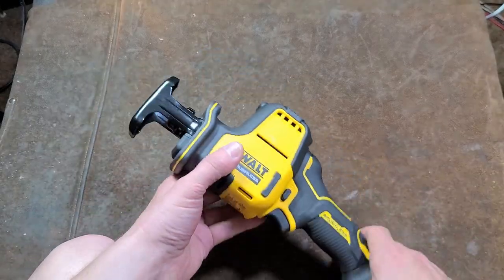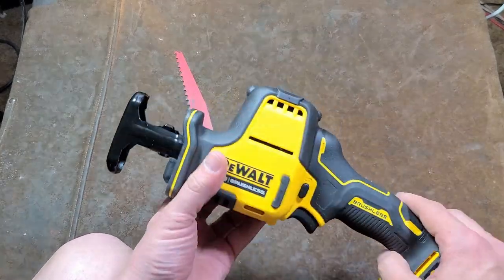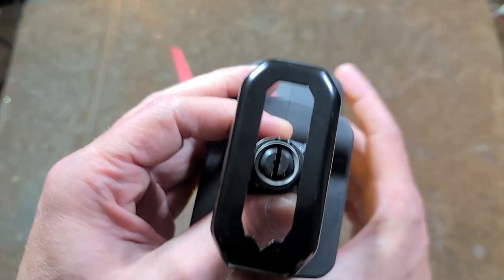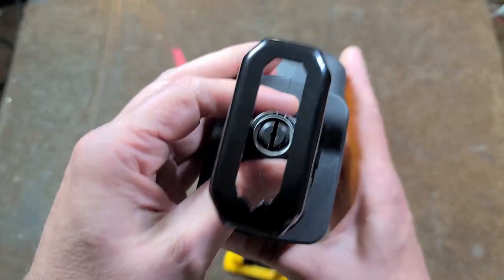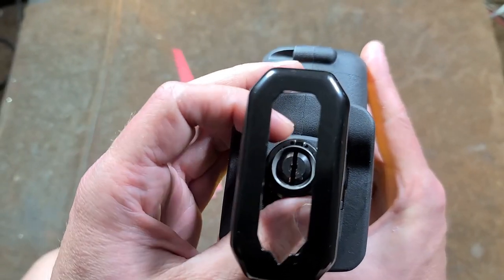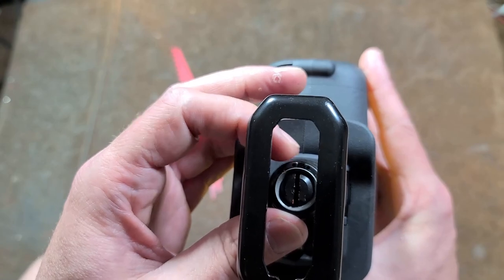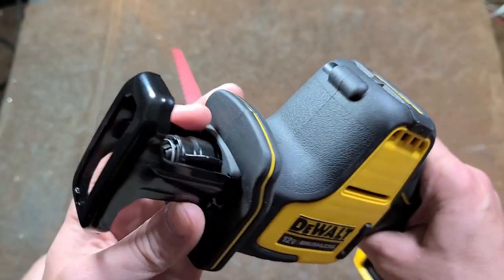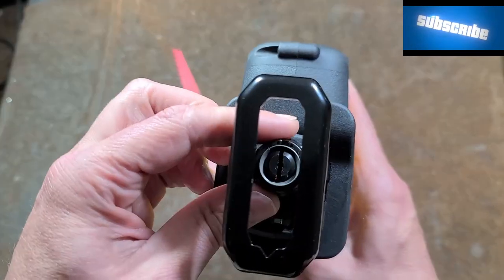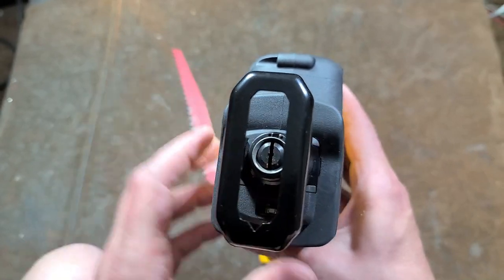Some things I've noticed: there's a snap ring that retains this rotating collar, and it appears to have a cross pin in it. My concern is that it's an internal snap ring — the circle is smooth on the outside — but they're using it where you should use an external snap ring. The little lobes would end up sitting above the chuck. I think they were worried about rotation catching fingers, but now this snap ring is not held evenly around the entire circumference — just held by an arc on the bottom and the two little nubs at the top.